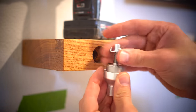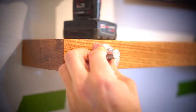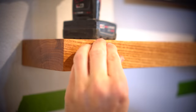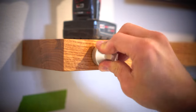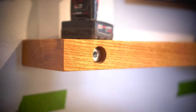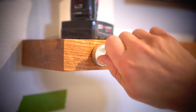Especially since it's now time to install our pika screws. I thread the t-nut onto the back side of our pika screw and insert it directly into our hole. Once it's placed there I then start hammering the back side of our driver and that fits it very nice and snugly into place. You may need to take it out a bit and drive in that t-nut a bit more to make sure the screw is as flush as possible, but as you can see, with a simple twist of the driver you can easily remove or reinstall each pika screw as needed.